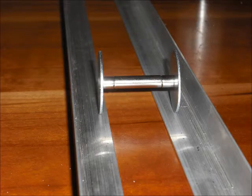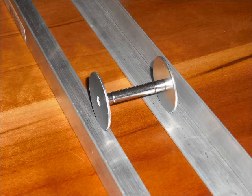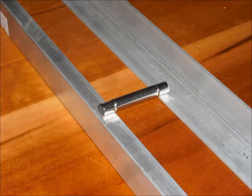So this was my original idea for my movable object on my 2 rails. It's going to have 2 washers on either end of a stack of magnets. Now I think this didn't work for a main reason, is that it was too heavy. The washers added too much mass to the system and the force could not overcome its inertia very well.